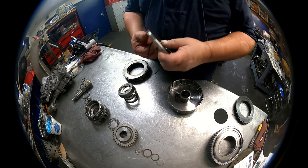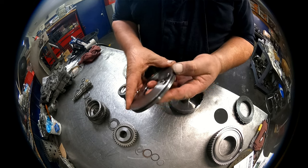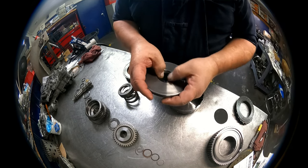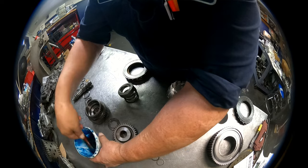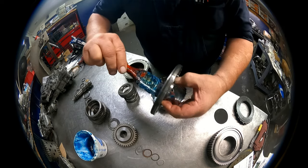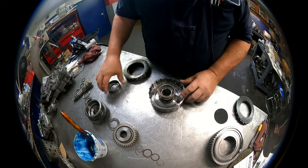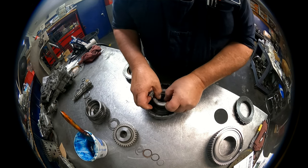All right, third clutch drum. That goes on the intermediary shaft. Usually the better kits have all the packages marked, so it's kind of a little bit difficult to mix up which one goes with what. You got an inner and an outer O-ring. Lubed that up really well. Now, I don't have a camera over at the foot press, so you're not going to be able to see that. Return spring, the retainer, short end of the taper of the snap ring up towards us again.